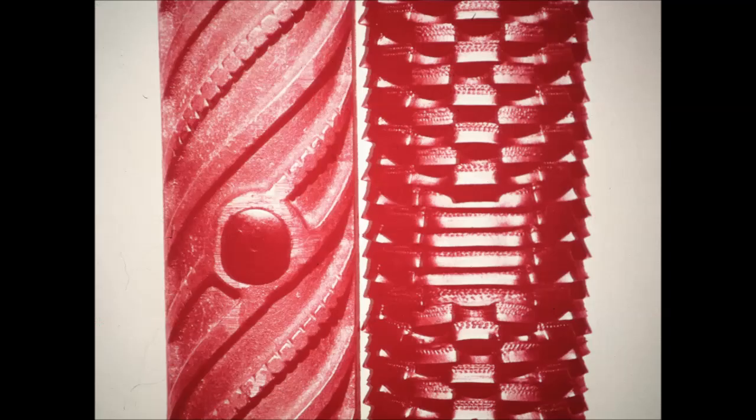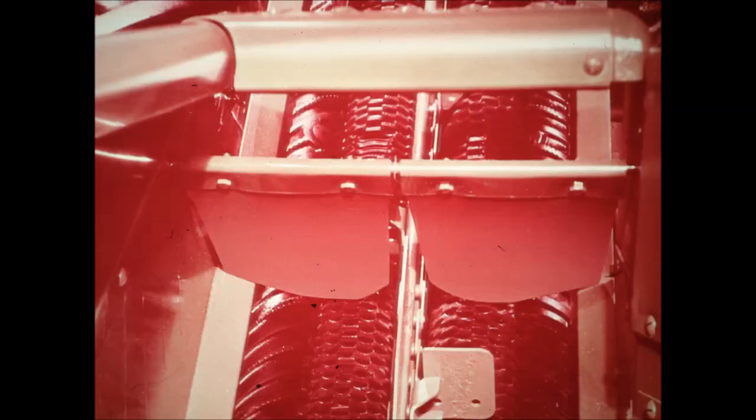Outer rolls are three-fourths of an inch higher, forming a trough through which the continuous conveyor moves the corn. Buttons are replaceable for long, economical husking roll life. Center fins line up ears for more efficient husking and keep ears moving smoothly. Trash retarders over the husking rolls prevent ears from rolling back into the first elevator and keep loose trash moving down through the rolls. A second set of optional retarders may be installed near the top of the husking bed.